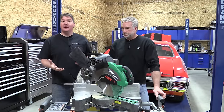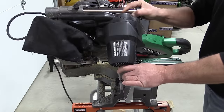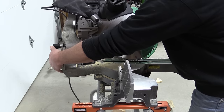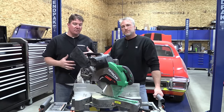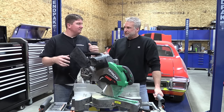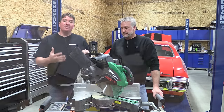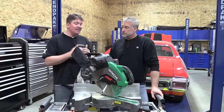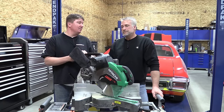Overall we thought this saw was a nice, powerful, and ergonomic saw. Maybe its biggest drawback was the bevel adjustment — you had to reach around to the back, and it always felt like you were going the wrong way trying to loosen it to make adjustments. Being that this is a zero clearance saw meant to sit against the wall, having to reach around the back to make the adjustment is going to be awkward and will push you away from the wall. The laser doesn't show all the way when you bring the head down, but that's not a big deal since it gets you started and then you use the saw blade to finish up — especially since it's a single-line laser and you always want to double-check which side of the blade you're on.